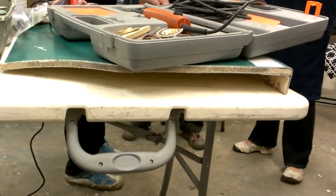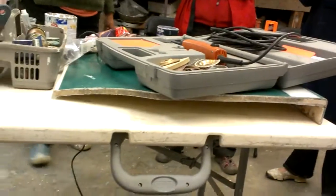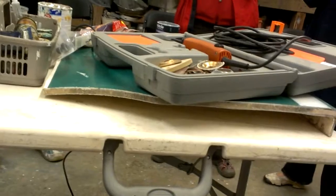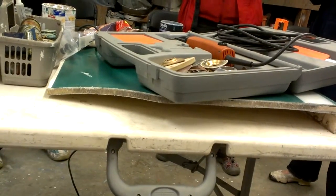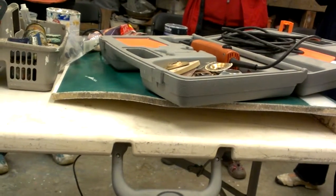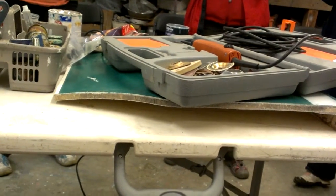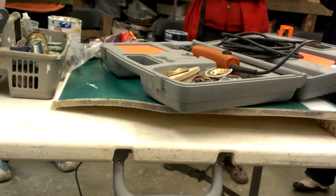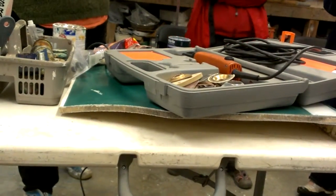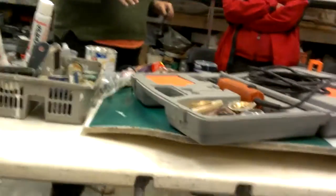All right. Because if you get this, the balsa core like that, that's probably what killed this boat. Perhaps the fasteners for the stanchions were not sealed, so you drilled a hole through something, and then you put bedding compound and you put a hole through there. What you should do is drill it out, take a Q-tip with epoxy or something, seal up that hole, then come back and put your fastener in, because you don't want water to migrate. Because at first, your stanchion is going to be fine.